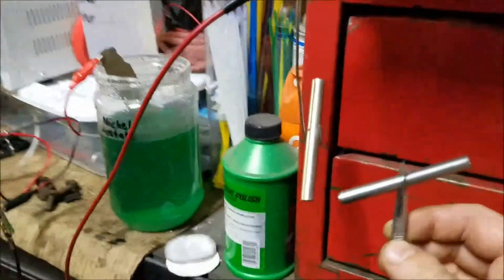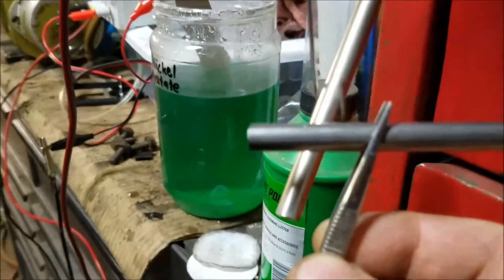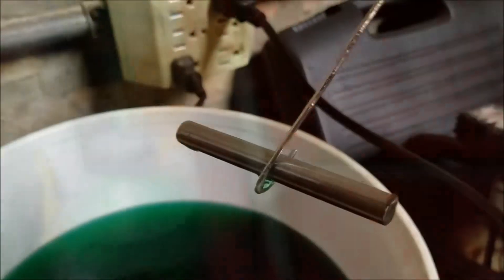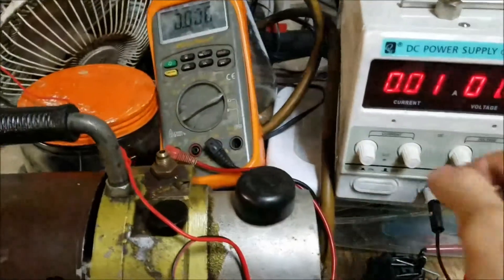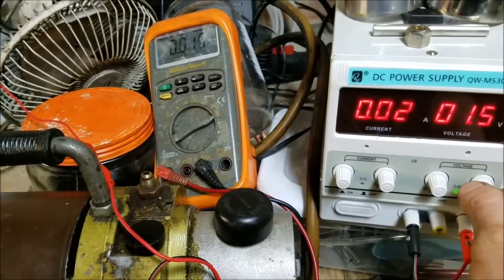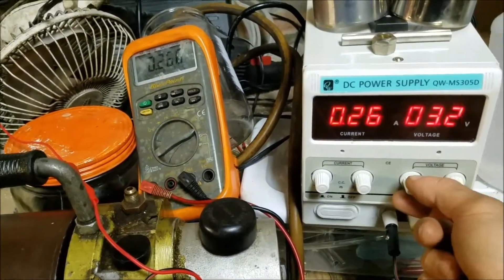However, later I did a little bit of research about plating bath contamination, and it seems like most of the time you can just keep plating stuff until eventually all the contamination just gets plated out and it'll be okay. But for the nickel acetate I'm not going to worry about it — it's just a little bit of vinegar, no great loss.